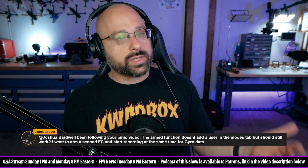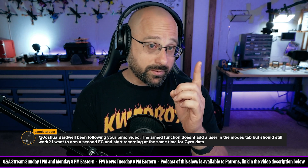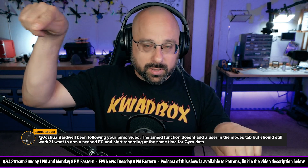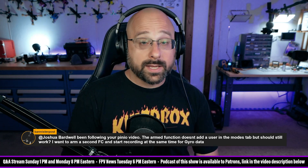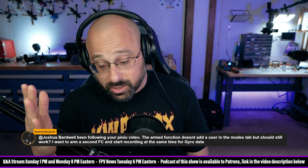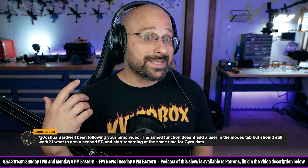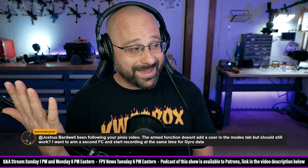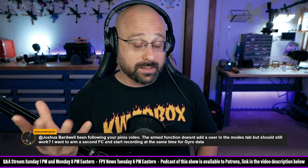So let's say you're using Crossfire or ExpressLRS. There's a TX pad on the receiver. You solder two wires to that TX pad, and both of them go to the two flight controllers on the RX pad. Now, one of those flight controllers is actually flying the quad, and the other flight controller is just sitting there, real confused. But both of them will receive the receiver signal.